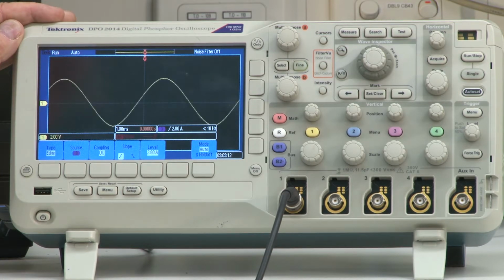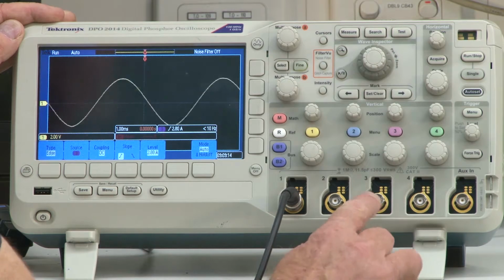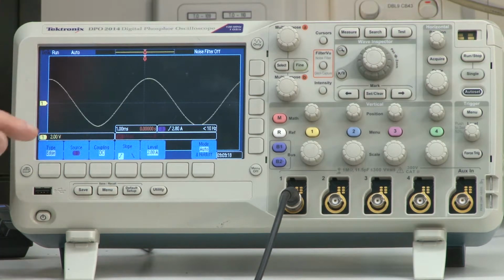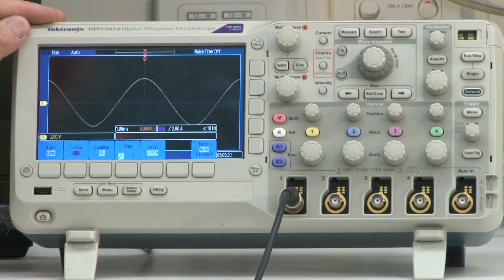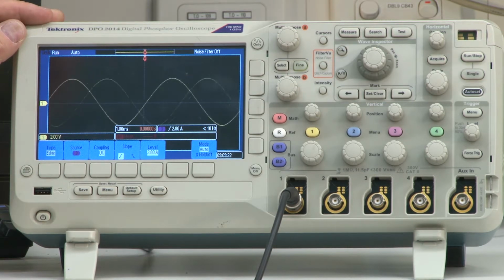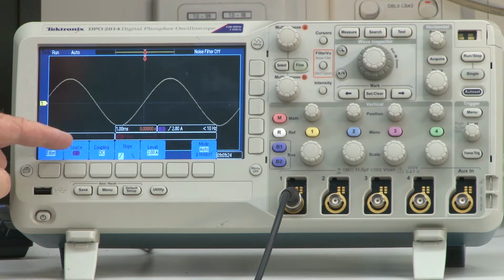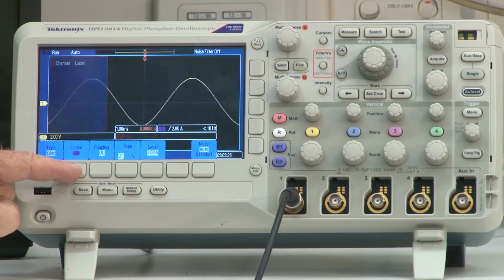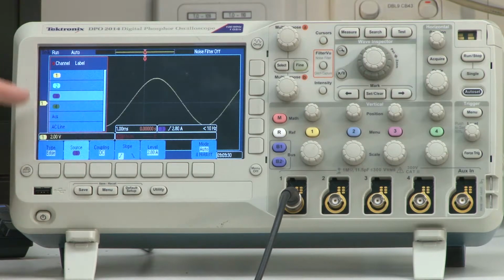It's a signal coming in on channel number 3. Well, have a look at this. There's actually nothing connected here. So what we really need to do is change our source of triggering. To do this, we're simply going to press the button that's beneath our source designator in the menu. We'll press it like this. This brings up another little menu here.